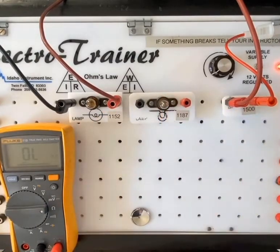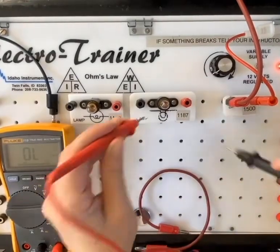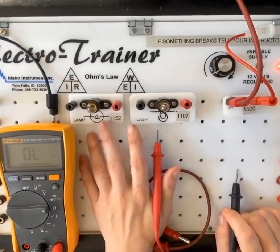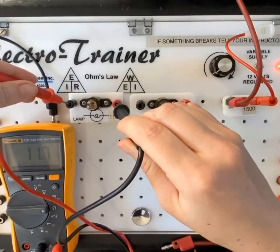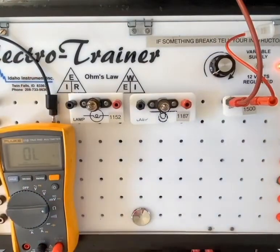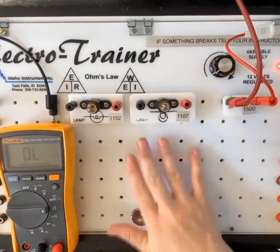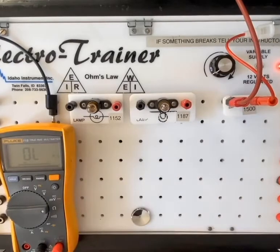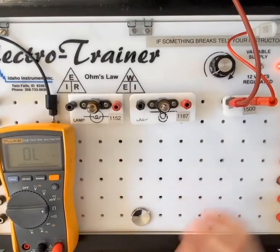Let's let that cool down and see if it changes since we did have it on. Now we'll do the same thing over here. We said 8.3 ohms and we'd guess this one is going to be more — and sure enough, we're looking at 11.7 to 11.8 ohms. So definitely a few ohms more worth of resistance, which we already knew because we calculated that out. In series circuits we see this one is brighter, so we already figured that out — but it's kind of cool to be able to see that on the meter in real life.